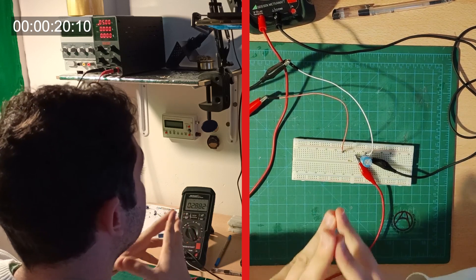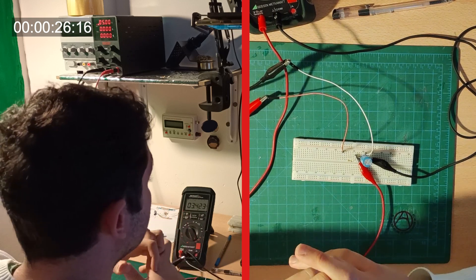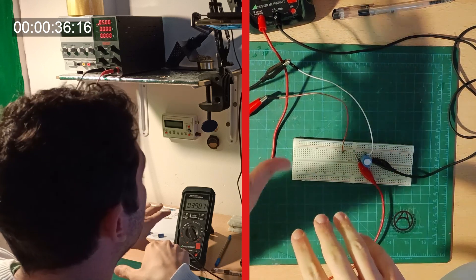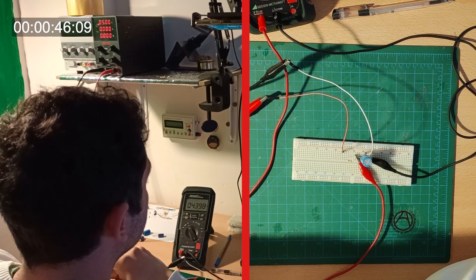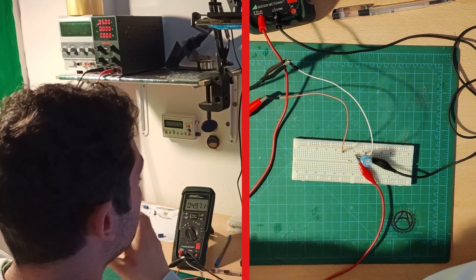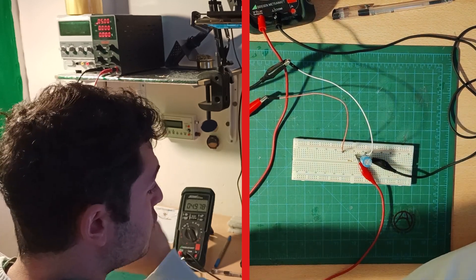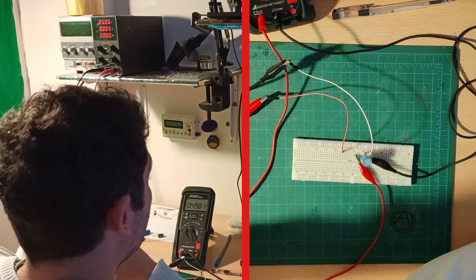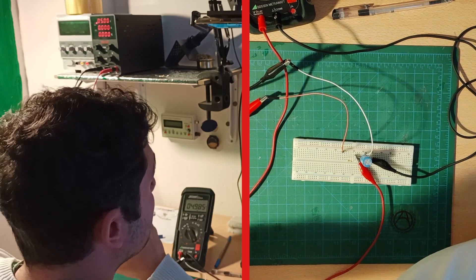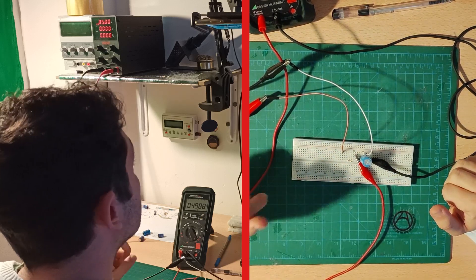When five time constants pass, our capacitor gets fully charged, and five time constants in our circuit is about one minute — so it takes some time; you just have to be patient. I'll speed up the video. After waiting, we are almost at five volts, which was the expected value. That was the first part of the experiment. I'll check the video for the measurement values at 22 and 60 seconds, and I'm pretty sure they hold because we set up the experiment well and our calculations are correct. See you in the second part.